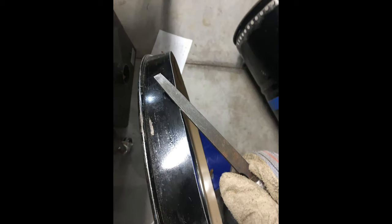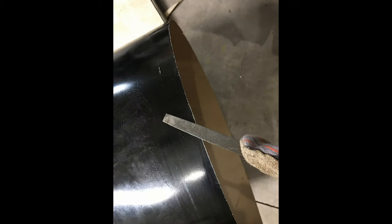You've cut that 1 and 3/4-inch measure. Now you know the routine — you've got to get rid of all the burrs the same way you're going to when you cut that 2-inch band next. Use your files, use your sanders, and we'll go ahead and start cutting that 2-inch band next.